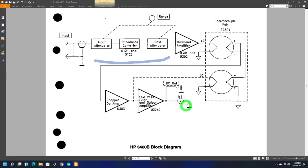The instrument does have a DC output voltage — we can just digitize that. However, this DC output is actually negative, going from minus one volt to zero, so we have to flip it for typical A-to-D converters. We'll use a 12-bit or 14-bit data converter, so we need signal reconditioning. I also want to draw all the power from the instrument itself — fully self-contained — without using any external power supply, which is challenging because you can inject noise back into the unit.